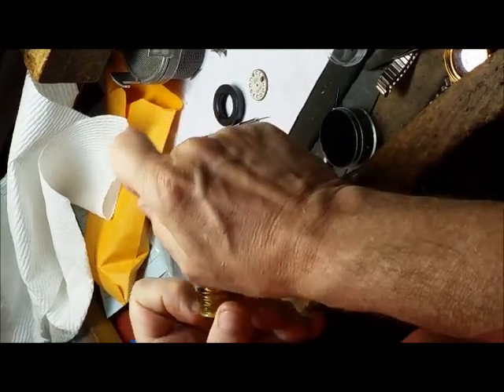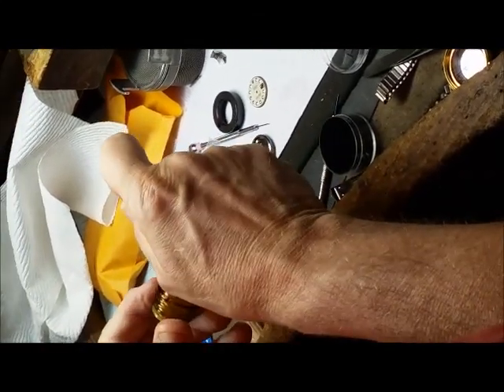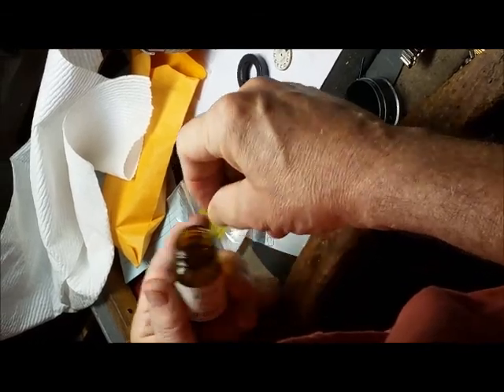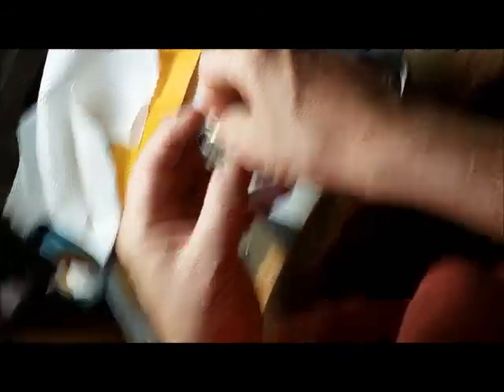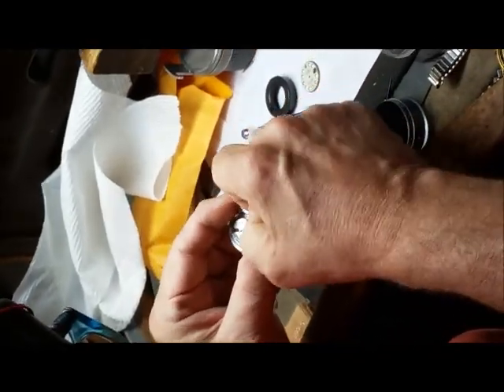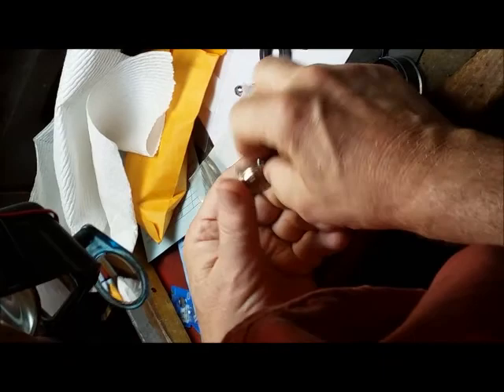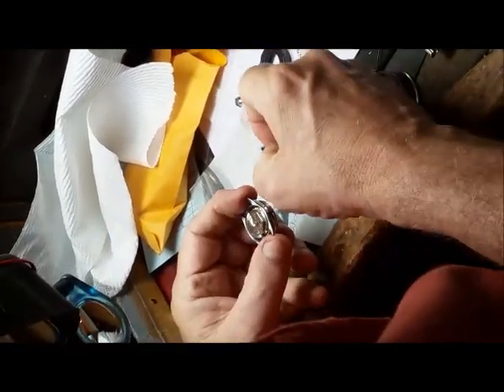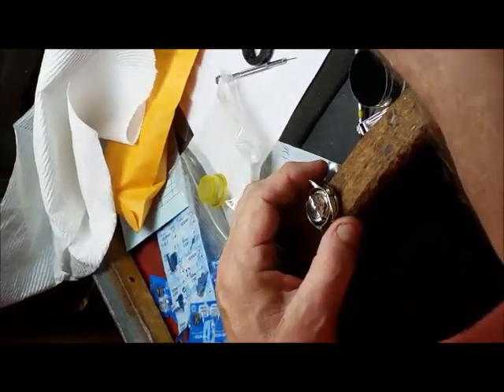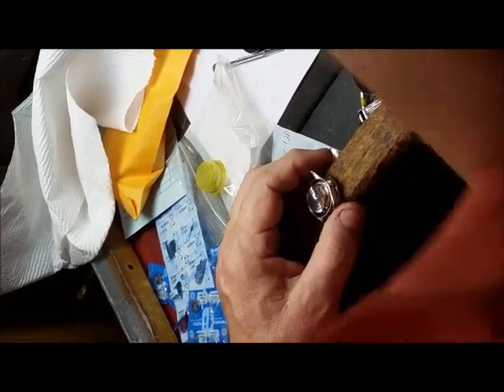It's a special type of watch grease — basically waterproof — it helps. Since it's a '69, she's probably not going to be taking it underwater anyway. He's not going to explain the locking stem — just going to have her set it and forget it. She'll probably only wear it for nice occasions, so you're the one who'll be checking the accuracy. When you go to put this watch on after it's been sitting a while, wind it about 15 times before you let it run, set the time, and you're good to go — or just shake it five times depending on how clean the movement is.